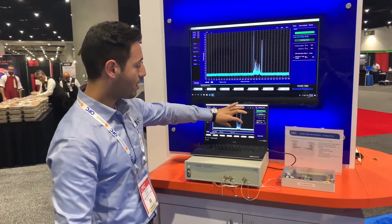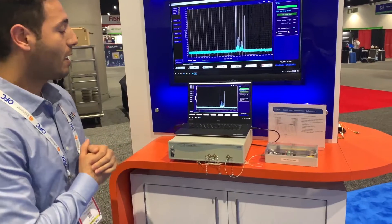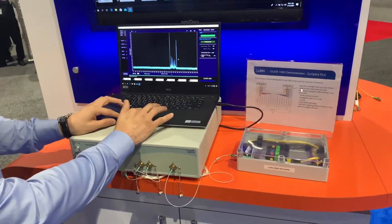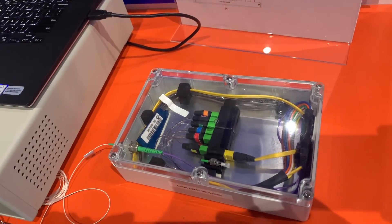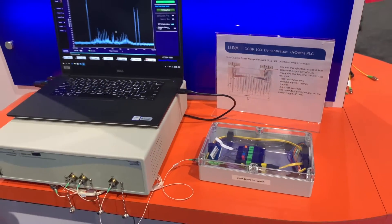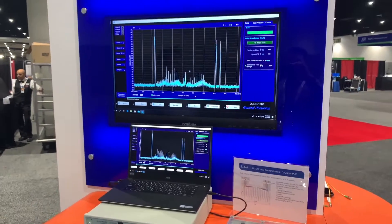In this case, we are centering around a waveguide which is inside this optical fiber assembly. We are looking at all the interfaces with 10 micron spatial resolution. It's an alternative way to look at any reflections inside any optical component with very high dynamic range and very low spatial resolution.